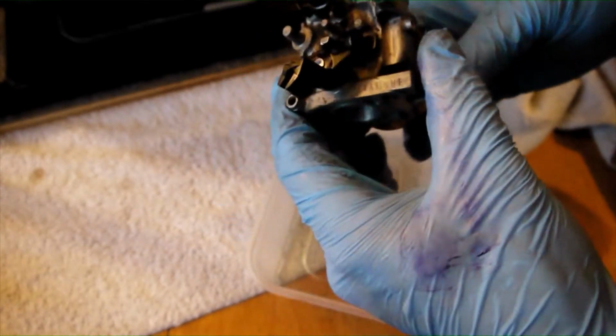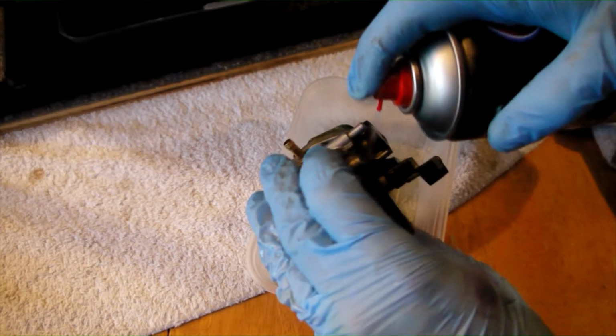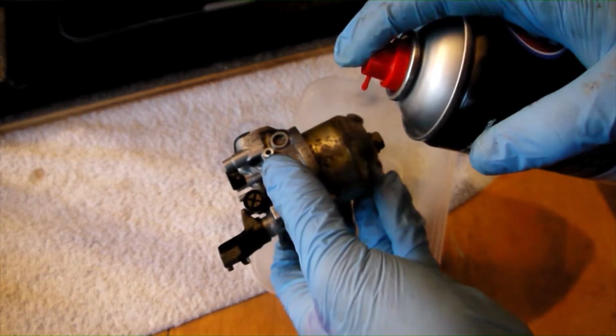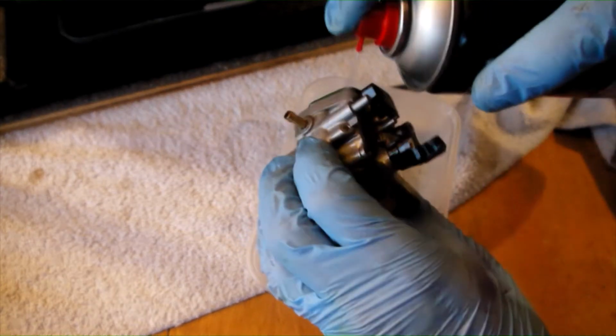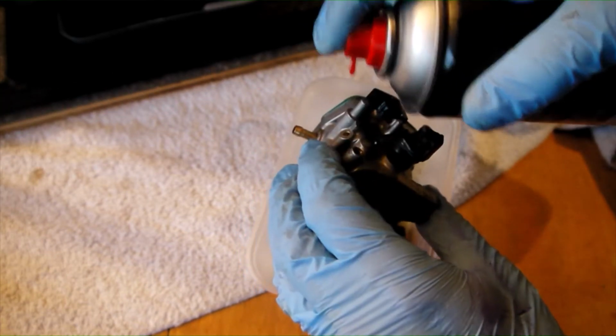It is also worth noting that carburettor cleaner can be used to clean the external surfaces just as effectively if they have become dirty or covered with oil. Shake off any excess liquid to stop it contaminating the venturi and other orifices which have just been previously cleaned.